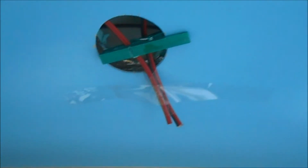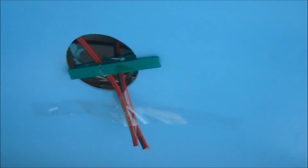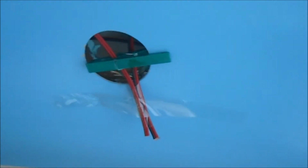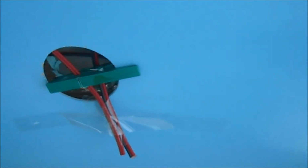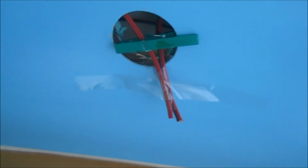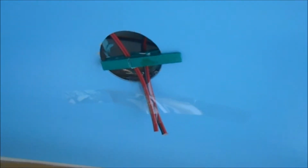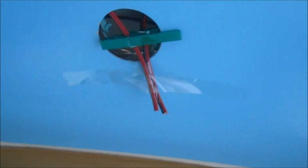But I've discovered that I fitted the lights and they didn't work, so I checked all of the wiring, took all of the connectors off, and refitted new connectors, thinking that maybe one of the connections was bad, because in a series, if one thing's wrong, then none of them will work. They still didn't work. So then I took off all of the lights and checked each light, and they all came on, and then I noticed that they didn't switch on and off. They weren't touch sensitive, and I'd ordered touch sensitive lights.